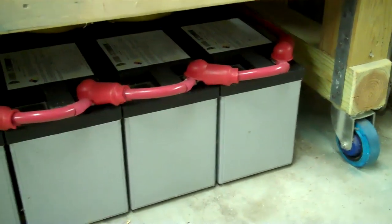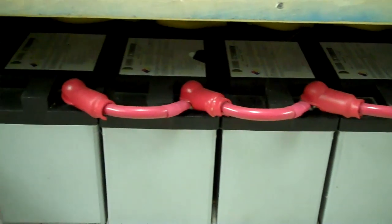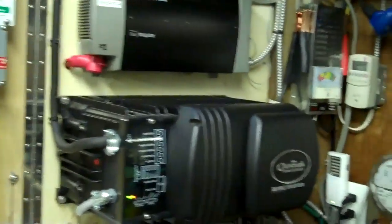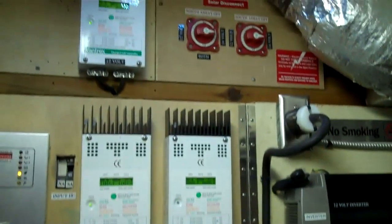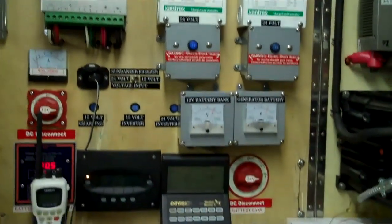The big downfall with 12 volt systems is cable size — that's the only difference. You have to run huge cables. These batteries look miniature but they're the size of a car battery and there are 12 of them — they're AGMs. I'll go into that in a battery video. One type I missed would be a pure grid-tie inverter, which is just grid tie. If you've got that connected to a bunch of solar and wind, remember: if your power goes out, you're out — it doesn't matter how much you have on the roof.